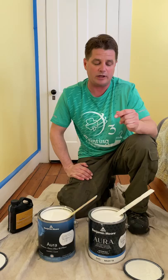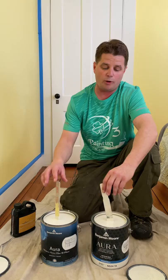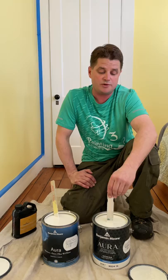So these are just some tips and techniques when trying to use the Benjamin Moore Aura. And hopefully I showed you some of the pros and cons of the old stuff versus the new stuff. Again, the newer stuff is going to be friendlier to use, whether you're a homeowner or a contractor, because it's going to extend the open time. It's not going to dry to your brush as fast. It's not going to dry in your roller tray as fast, okay?